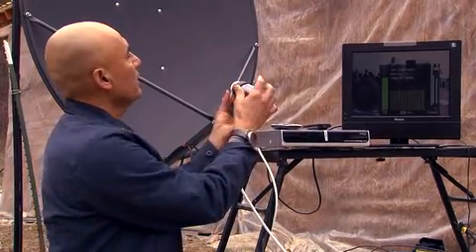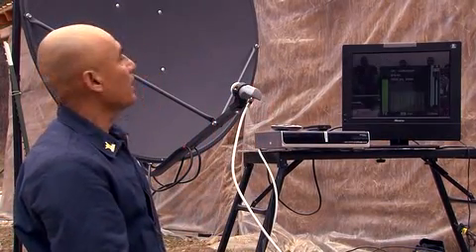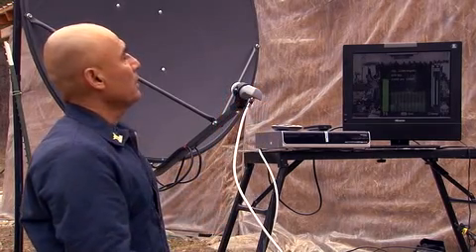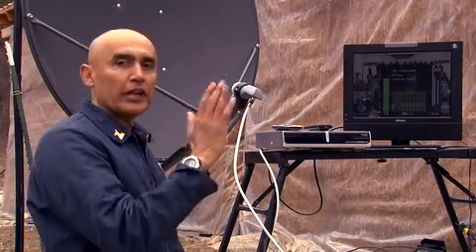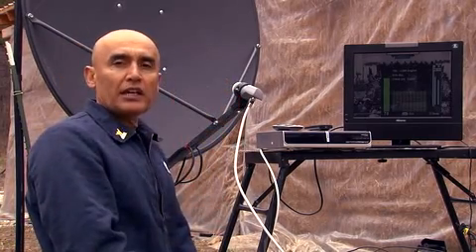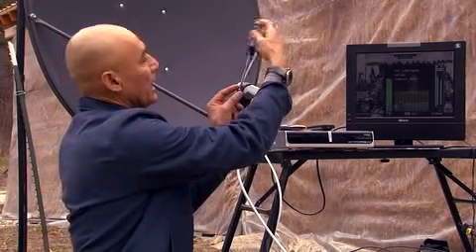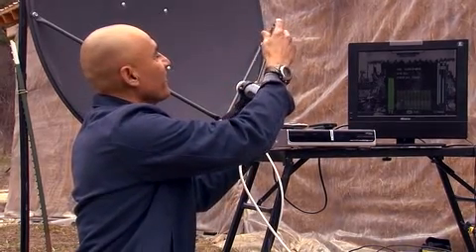That's 79. Just a hair more maybe. Looks like I went a little too far, so I'm going to leave it right there — moving it just a little bit more will calibrate for any cloudy or rainy days. The next step is just to tighten down your clamp and you're done with your alignment. Easy as that. Now visit our website at www.IdealSatelliteServices.com — thank you.